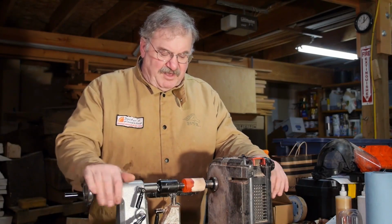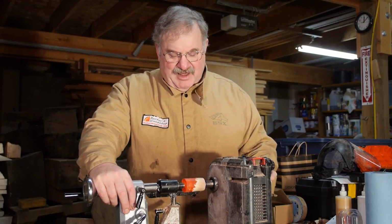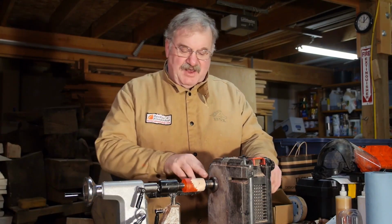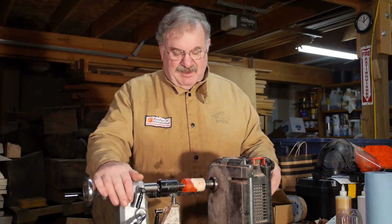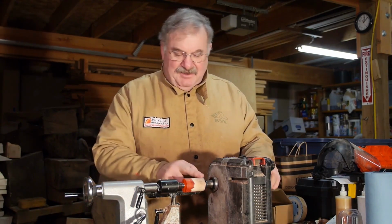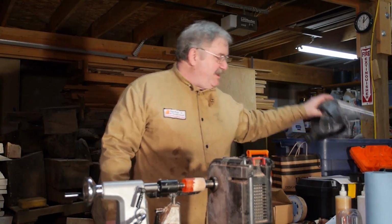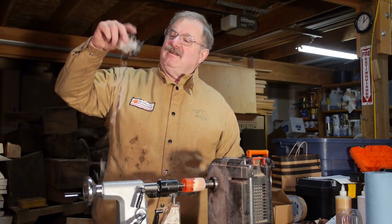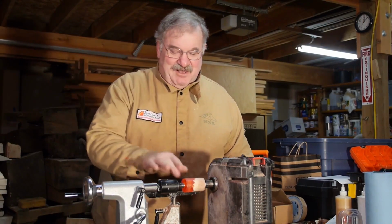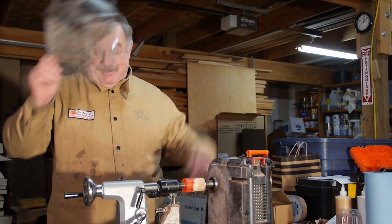I have queued up here one of the Alumilite and maple burl hybrid blanks for a bottle stopper. It's threaded onto the bolt holder that's been trapped in the draw collet. And as you can see, I've got it started rounding out. The Alumilite cuts very delicately once you get it roughed out. But in the roughing process, a face guard is always a good idea.